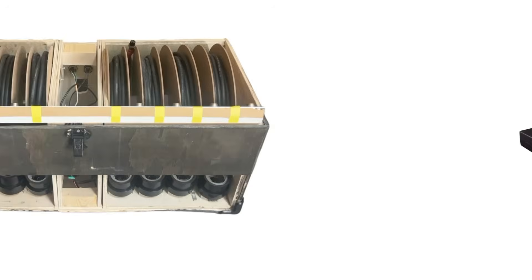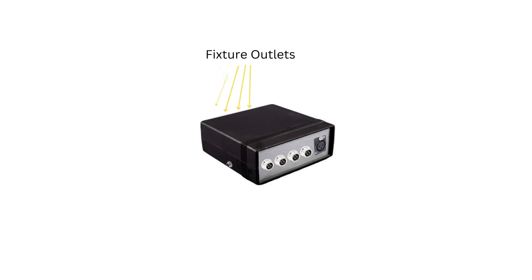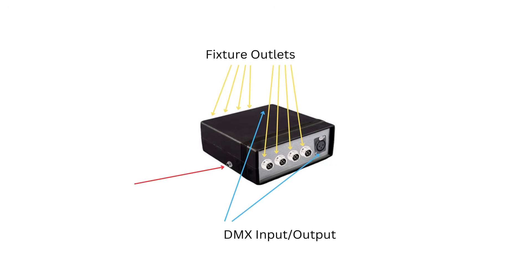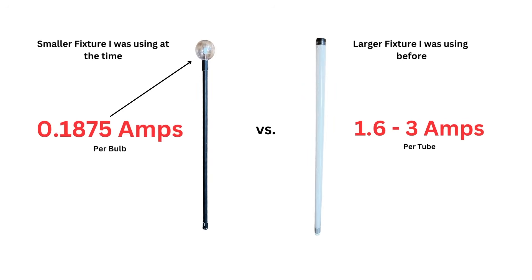So for the second version, I went away from the spool idea and put the DMX decoder in a small electronics enclosure with eight outputs for the bases, a DMX input and output, and a small 12-volt barrel jack for the power supply. Now I obviously couldn't fit anything else inside of these enclosures, let alone the giant power supplies that I was using before, but the fixtures I was using at the time were much smaller and drew a lot less power so I didn't require all that amperage.